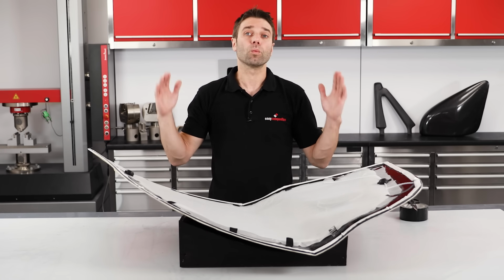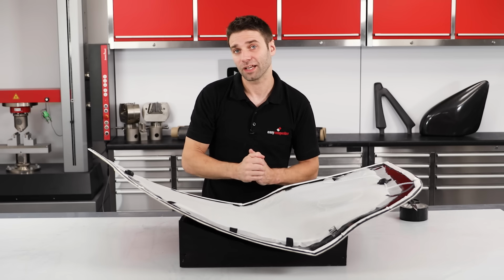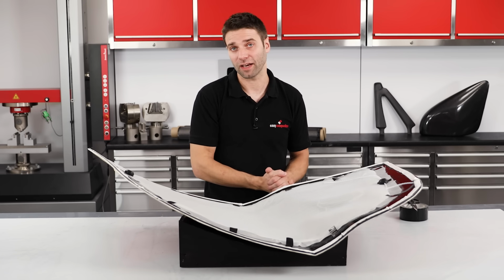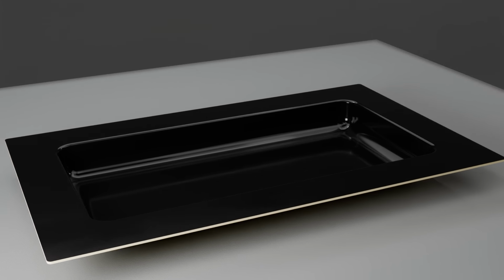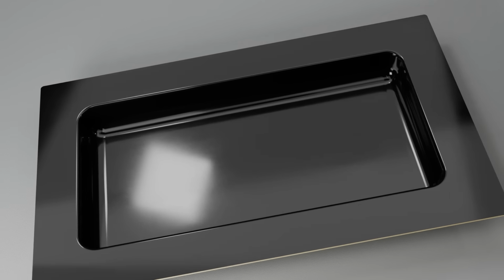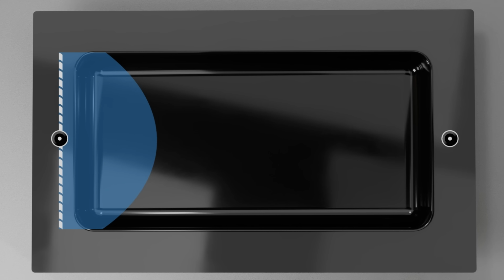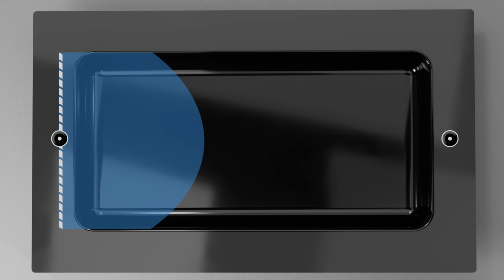Taking a simple 1 meter by ½ meter rectangular part as an example, let's look at some different layouts and how they would affect flow. I realise that you're probably not making a perfectly rectangular part, but all of the principles we're going to cover could be applied to almost any component. If we have our resin inlet and spiral at one end and our vacuum at the other, the resin will flow like this. You can see that it takes an arc shape from the connector and flows across the part, gradually getting slower and slower.